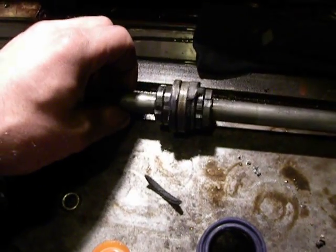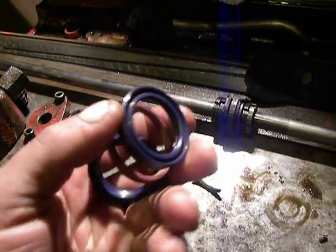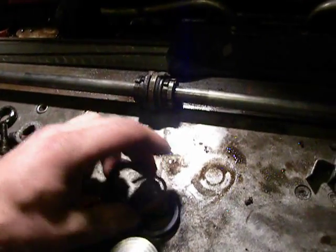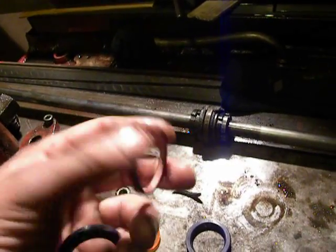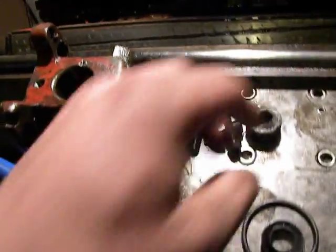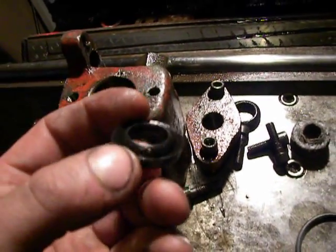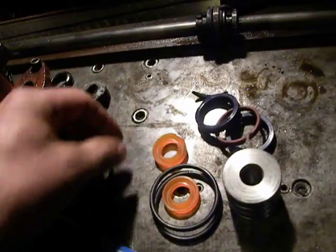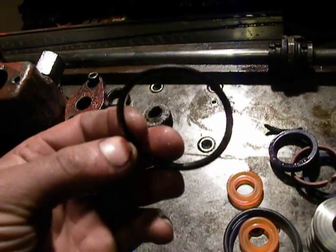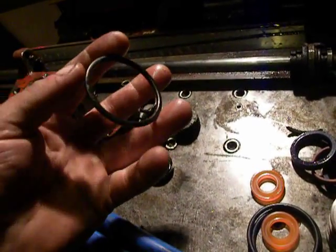Also, it's made from leather or wool and I exchanged it to new plastic seals, and I advanced it so that it won't damage the cylinder surface. Also, the cylinder end and seals too were old and damaged, and I exchanged them to new ones. These rubber rings stay hard and can easily break.